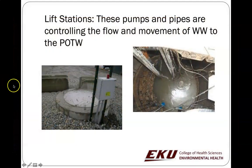Lift pumps often grind up or break down the waste as well, and they have to be maintained over time. The metals can corrode very easily. They can overflow if the pumps go bad, so they have lights on them to warn us. Sometimes there's an antenna that sends a radio signal or a telephone call saying it's overflowing. Pumps can fail — they get clogged by things people flush, like clothes. It may rain a lot, causing broken pipes, and the pump overheats or the incoming water exceeds what the pump can handle.